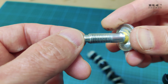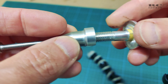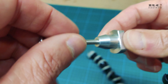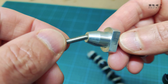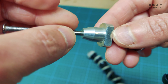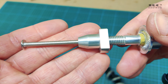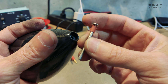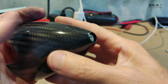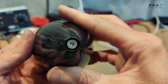If you have a propeller shaft with no inner thread, you need to make a custom part which has the right inner thread for your propeller shaft and the other end the inner thread for your center spinner screw. I had to outsource this part to make it fit perfectly — it's a good solution but a bit more expensive. On this example, the screw was narrower than the hole on the spinner, so I took some shrink tube, put it around the screw, and like this I was able to minimize the play of the screw to a minimum, keeping the screw perfectly centered when tightened.